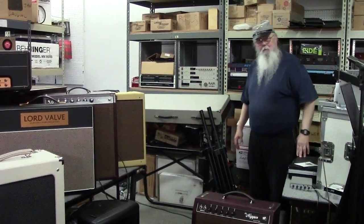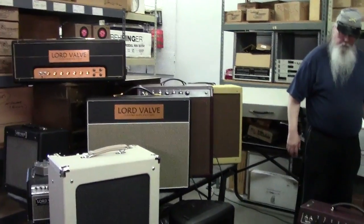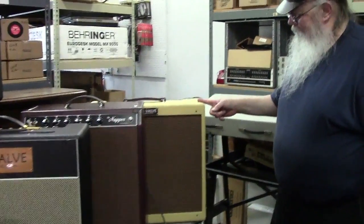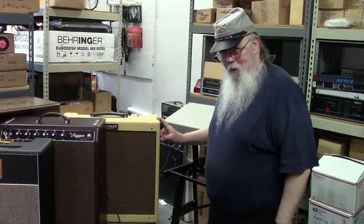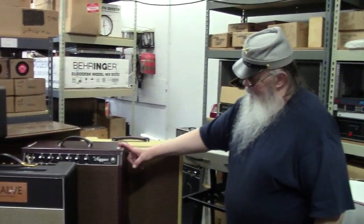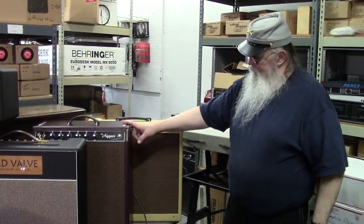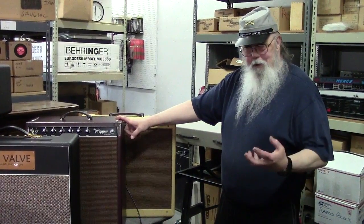Willie's turned on the lights here in NBS Electronics. It looks like this is the showroom — yeah, there's stuff laying around. I build a lot of these; I've built five or six of them. This is a 1956 Fender Tweed Pro clone to the original spec — beautiful sounding amps, 22 watts. This is my 44-watt Napper with the 15-inch speaker. It's got the same preamp as the 12-inch Napper, which is my most popular one, but it's got a 6L6 output stage running at higher voltage with bigger iron.